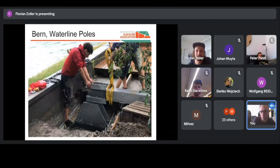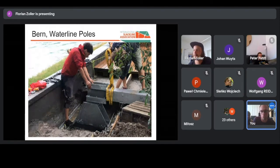I just was on the line for the first time 3 days ago, but we still need to tweak a little bit. So this was a big challenge because we basically don't have the space to go to the back with any tiebacks and so on. Maybe temporarily, but definitely not permanent tiebacks. So the foundation has to be super strong.